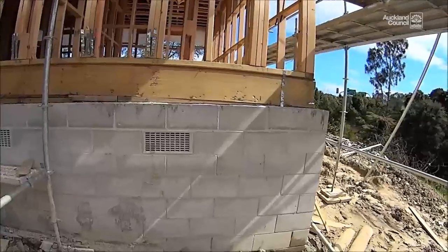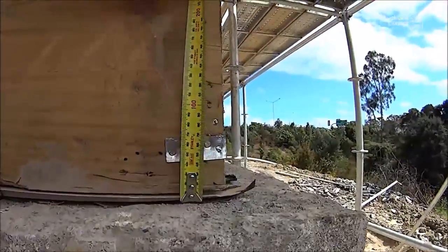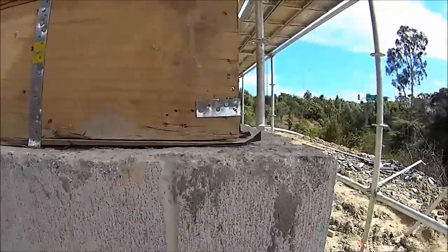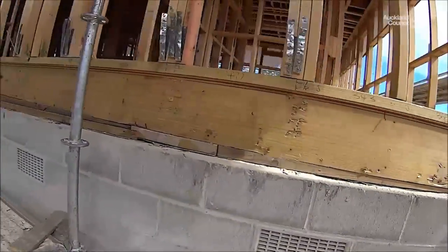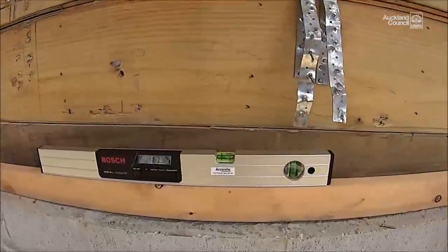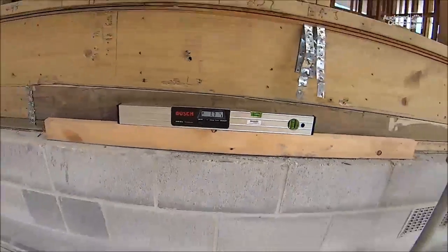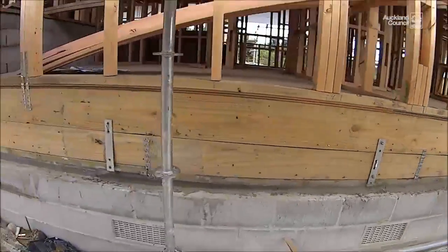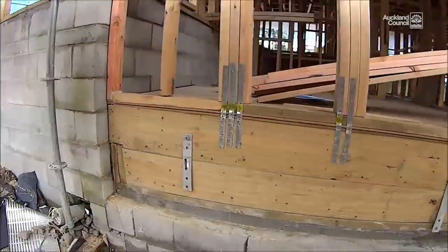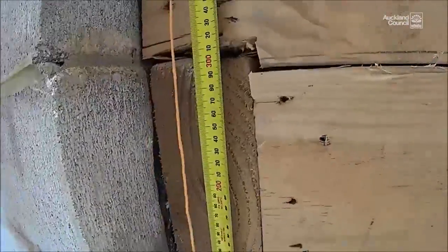On the southern elevation, there's a boundary joist at this end of the building fairly close to being hard down on the concrete block foundation wall. As we slowly move up the length of the building, you'll see the packer below that boundary joist increase in size. A level set up here shows it's nearly half a bubble out — just under two percent that block work has been laid out of level — and the packer has really started to increase in size, reaching about 290 millimeters at this end.